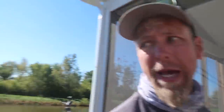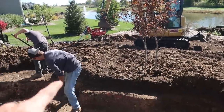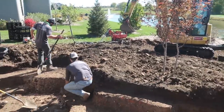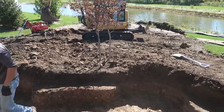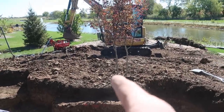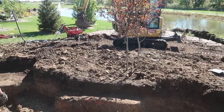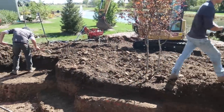We've made really good progress being efficient. We had to build up the entire back side of the pond because everything sloped hard away from the house — about a foot grade change from where I'm standing to where Matt is. We lucked out that we won't have to pull up the Japanese maple, because the grade right here matches the base of the root flare of the multi-branched maple. We'll shave some dirt down but I left it high so we can backfill against the liner as we rock the pond in.